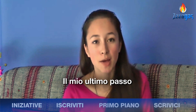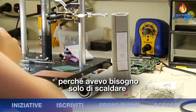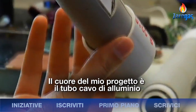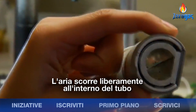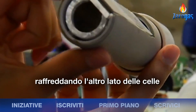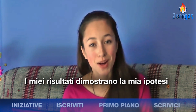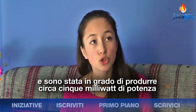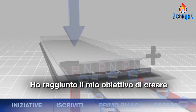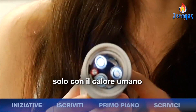My last step was designing the physical aspect of my flashlight. Because I only needed to heat one side of the Peltier tiles, the heart of my design was a hollow aluminum tube. The air flowed freely through the tube and also cooled the other side of the tiles. My results proved my hypothesis and I was able to produce around 5 milliwatts of power and 5 foot candles of brightness. I achieved my objective of creating a flashlight that runs solely on the heat of the human hand.